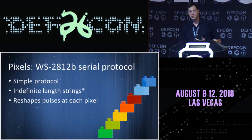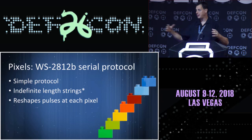So the way they work, it's a serial protocol, so I don't have to have an address for each and every pixel. You can extend the strings out indefinitely. Now, there are some realistic limitations to the amount of power you can push down the string. But what happens is three values come out, followed by three more values, and you can think of it like a stack of colored Lego blocks. The first pixel controller grabs that first set of three color instructions, pulls it off the top and displays it, and then pushes out the rest of the stack onto the next pixel in the chain. So it's first in, first out, but it strips that first one off the head and moves them down the line.